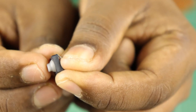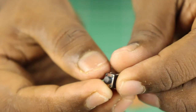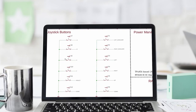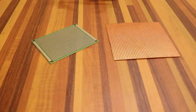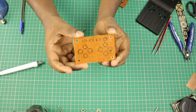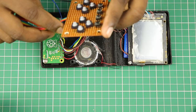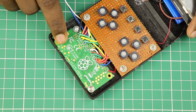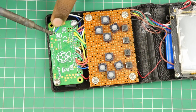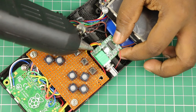It's time to assemble the buttons. I have bought some soft tactile elastomer buttons for the controls — this will not make the clicking noise, which will give a perfect feel while playing games. For the rest of the commands like SELECT and START, we can use the regular tactile buttons. We need at least 12 buttons. I am going to use a perfboard to place them. There are pull-up resistors in the Raspberry Pi itself, so we can solder the buttons alone and interface it to the Pi using the GPIO interface. We can supply the 5 volt output from the DC-DC converter to the Raspberry Pi using the pads available behind the micro USB connector.